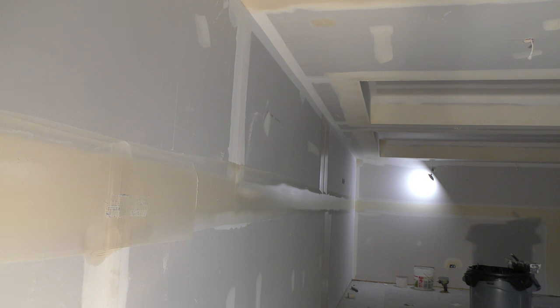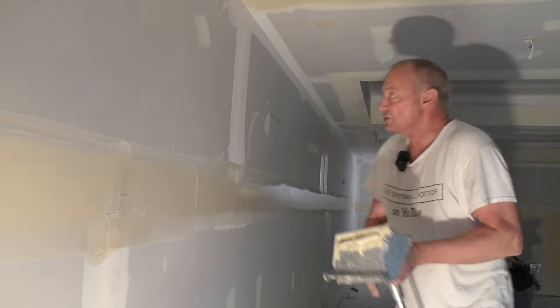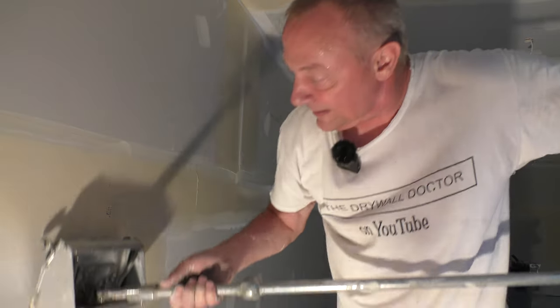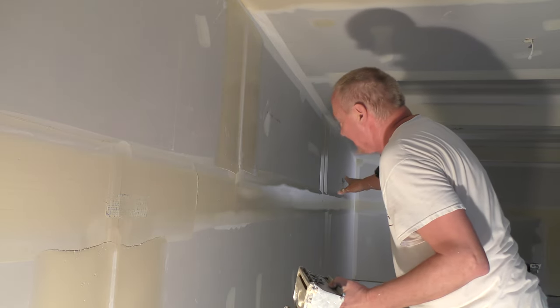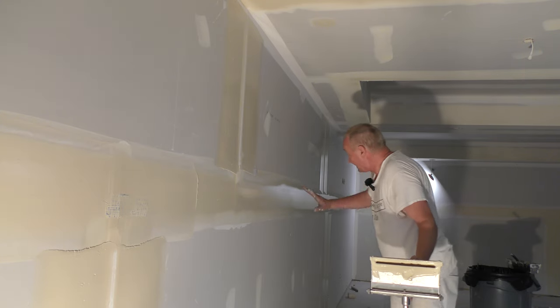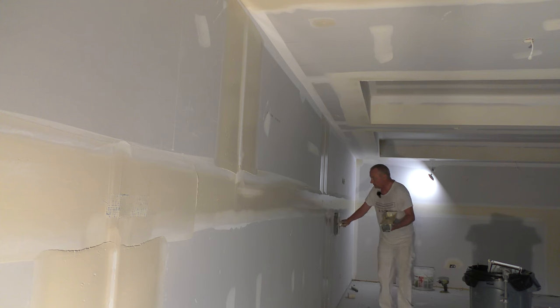The most important thing is the mud. Obviously if the mud is too thin and the gap is too deep it's just going to sag and fall down the walls. If it's too thick I'm going to be working way too hard. But if I have the mud just right it just boxes so nice and keeps it so clean. This is ready for a 12 box — I don't have to do anything with this, it's ready to 12 box, ready to skim one coat and it's done. So let me show you how I cross these off.